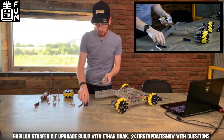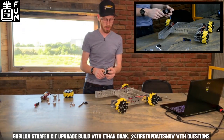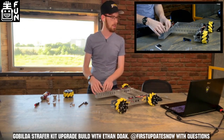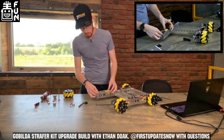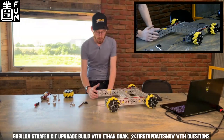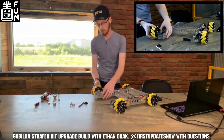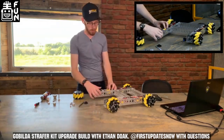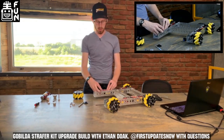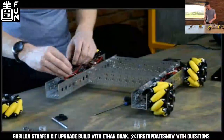We've got that motor assembly done. Now we've just got to slap that miter gear right on to the output shaft of the motor. Now we put it back in the channel. We want to put our drive wheel on this second hole — look for the next hole back, find that vertical slot, and shift one hole back from that. It's the same hole placement you're used to on the strafer chassis you just took apart.